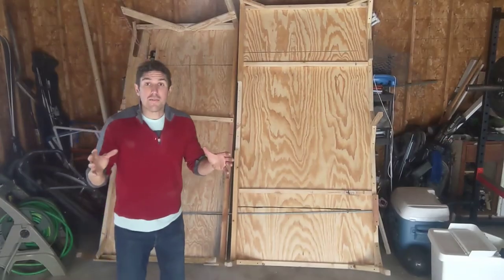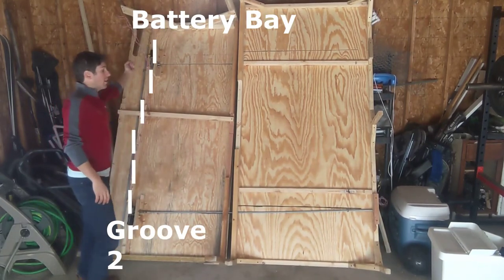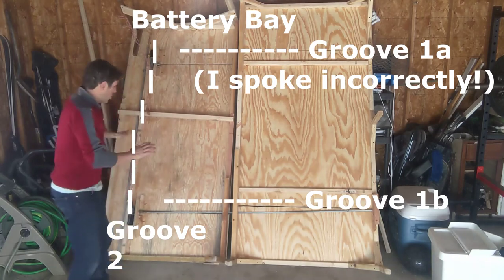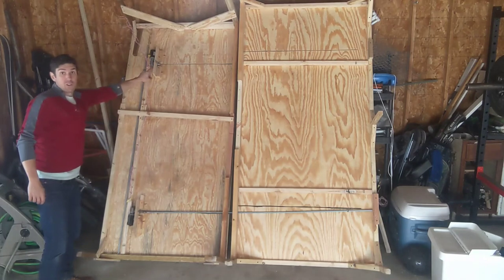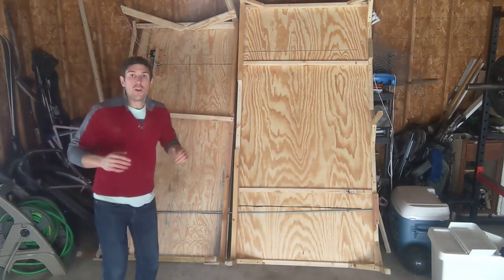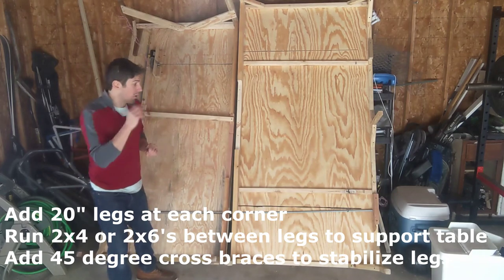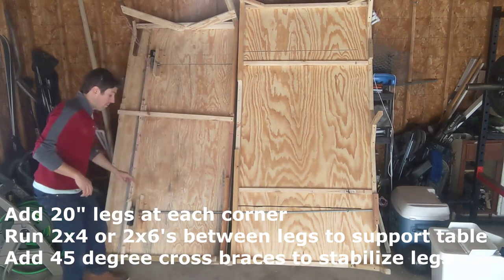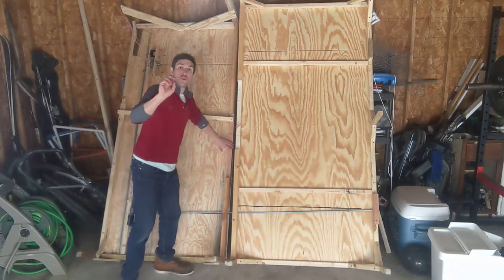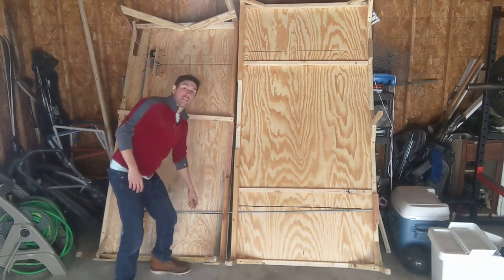With the tables flipped up, you can see the threaded rods underneath — those drive the arms across the table and toward the battery bay. To get started, make a table from each sheet: legs are 20 inches long using 2x2 or 2x4. Add supports around three sides, but in the middle use 2x6 because you'll be taking a notch out there to allow the threaded rods to pass through. Add cross braces with 45-degree cuts on the legs to keep them from wiggling. Note that one table is slightly smaller — 4 inches taken off the top and side — so it can nest inside the other like a Matryoshka doll for transport.